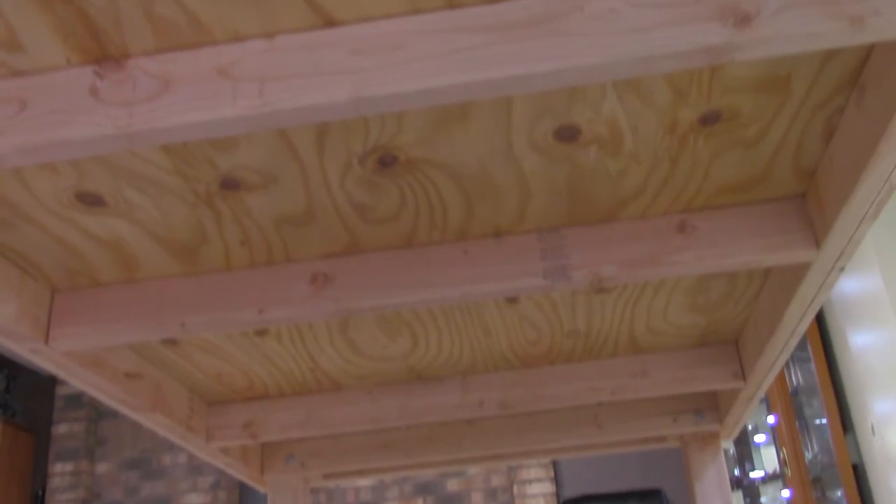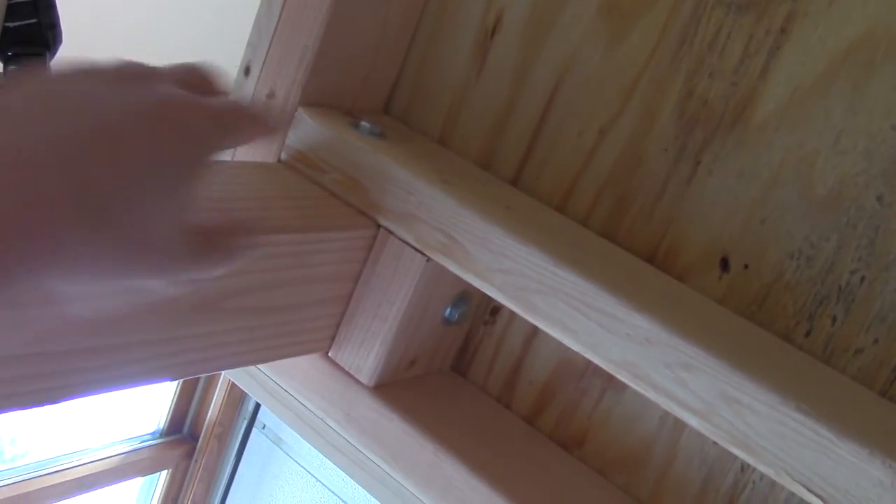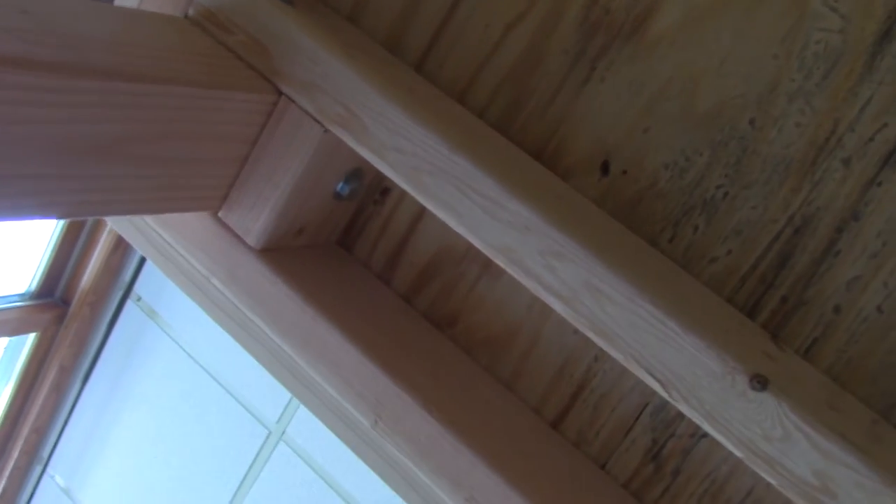I'll give you the best look I can here. We've got two-by-fours framed up underneath. I made little pockets with the two-by-fours. I've put some leg bolts through this side and through that side to help with lateral movement. So if somebody hits the table on this edge and leans against it, the leg bolts from this side will hold the legs. And if somebody hits from this side, these leg bolts will hold that lateral movement and keep things from shifting. I did that on all four legs.